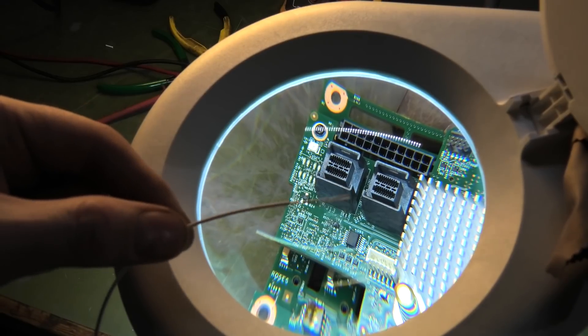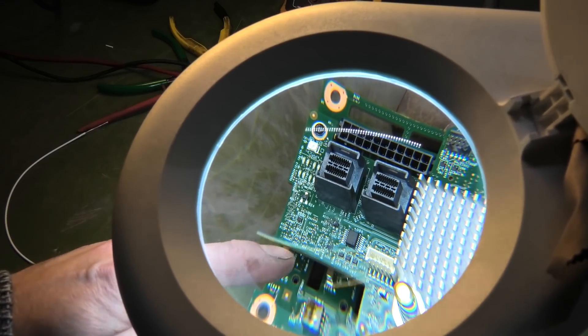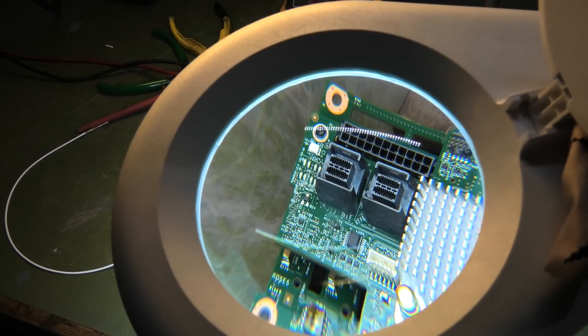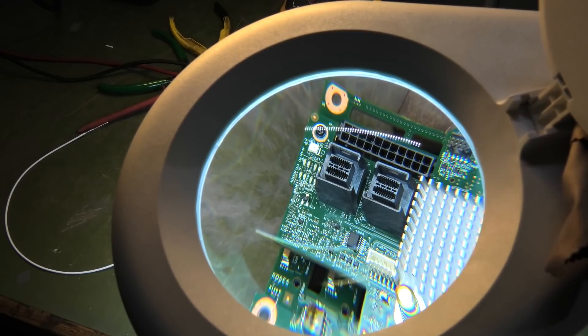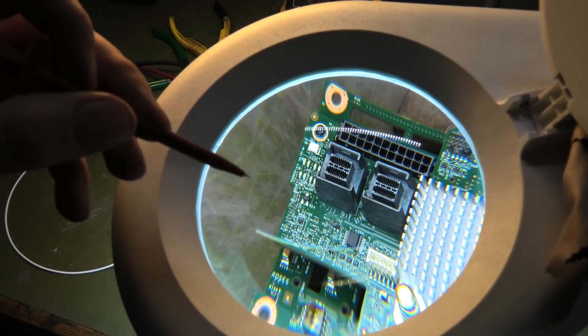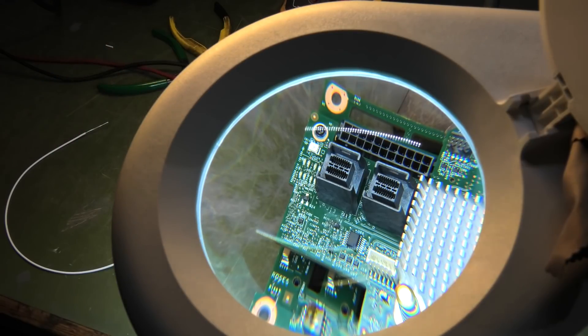Really tedious and intensive work. I connected one of the wires — just a normal tiny wire that can't draw a lot of current — to that leg and over to the resistor. I couldn't put solder on the soldering iron because every time I did it would just pull the resistor away in a blob of solder. So I put a tiny bit of solder on the pads and a tiny bit on the wire, cleaned the iron, placed the resistor down, heated it up, and it would kind of stick — but the slightest movement and it was centimeters away from where it needed to be.